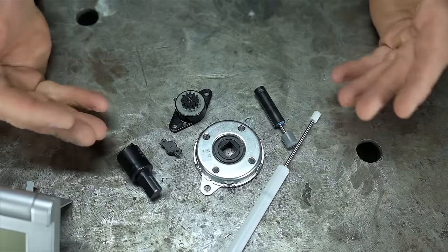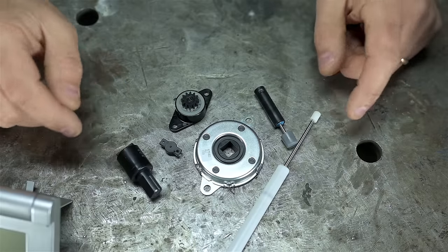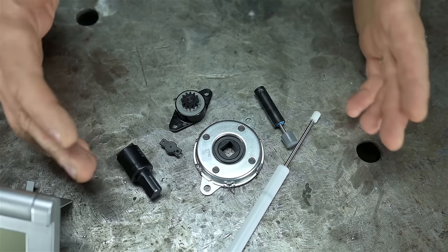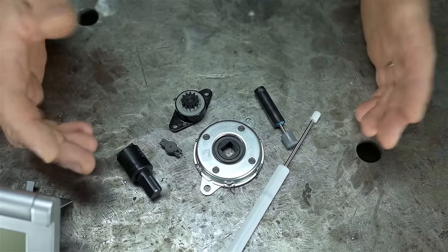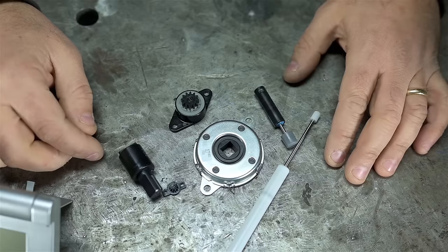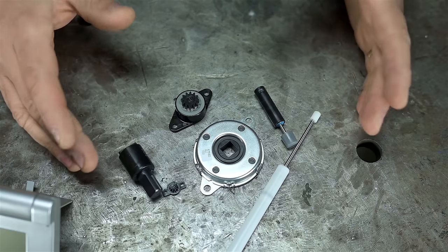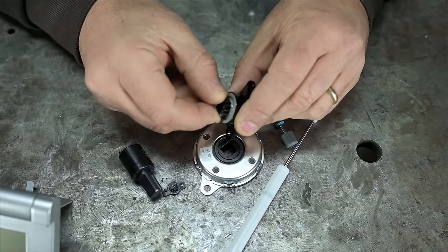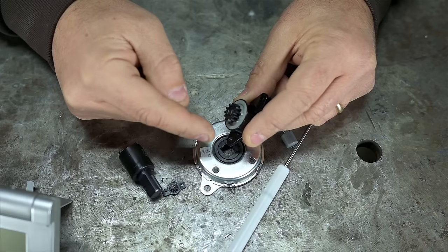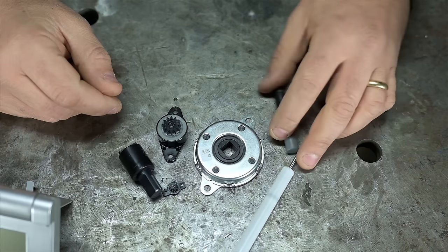I should add that these are off-the-shelf, plug-and-play accessories — Industrial Lego, as our neighbor to the north so eloquently puts it. You pick the shape and size you need, make sure it's rated for the forces you're dealing with, and just plug it into the thing you're building, essentially. On top of that, they're not very expensive — maybe 50 cents for a small one, up to a buck or two for some of the bigger ones. The selection is huge; they'll start from a fraction of an inch-pound rated torque up to tens, if not hundreds, of foot-pounds. You can get them so they damp in both directions, or damp in only one direction, meaning they'll slow your thing down in one direction but pose no resistance on the return. The exhaustive selection here includes two types: linear and rotary.